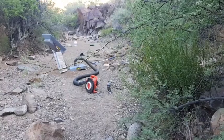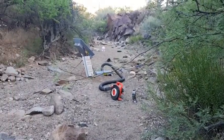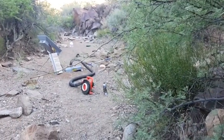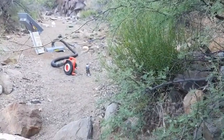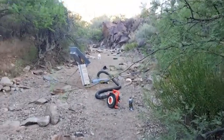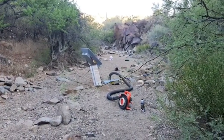The other thing I was finding I disliked yesterday is how low that dry washer sits to the ground. It seems like every few shovels you gotta go up, and I'm not used to having to clear the tailings from in front of the dry washer that come off of it. I think the Royal sets up a little bit higher, and I could just shovel, come by every so often and clear the tailings. But it is kind of nice you don't have to throw the material up so high after you're tired and digging all day.